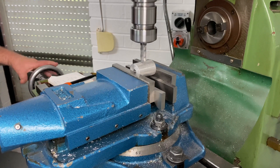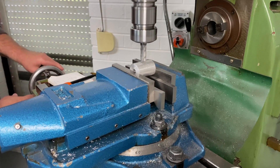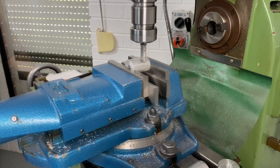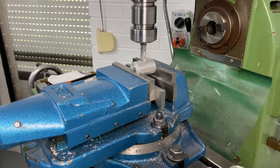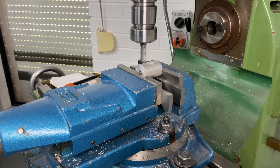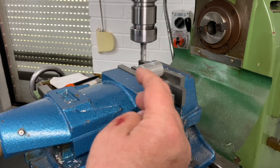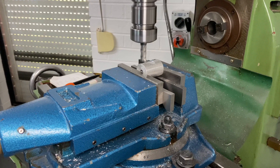And there we have it. Now I'm going to come off that job and I need to plunge down 4.6mm — I'll do this in two cuts under power feed. The reason for these little tabs is it allows me to put a spanner on there to tighten these up and pull it down tight towards the bed. Should be my final cut now.